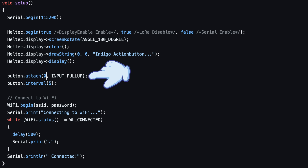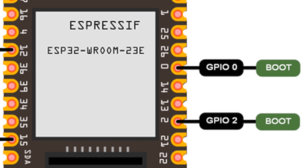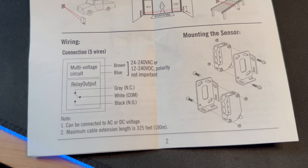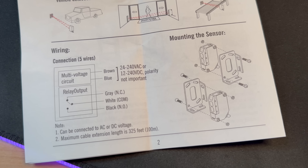The next step was to connect the sensor to the ESP32 module. Here's where I made a bit of a mistake you can learn from. Because I was bench testing as I was coding it, I used pin 0 as my input, since it's connected to a convenient button right on the Heltec module. That enabled me to get the code working and reacting to the button press as if it were a contact closure. The only catch is that pin 0 is also a bootstrapping pin on the ESP32, meaning that if your sensor is triggered while you turn on power, it will try to enter chip flashing mode instead. So, even if you use pin 0 for testing, pick a different pin like pin 5 as your actual input when you wire and deploy it. The sensor has about 6 feet of multi-conductor wiring — blue and brown are power inputs, and black and white are the contact closure wires. There's also a normally closed wire; in my case I just taped that one off.